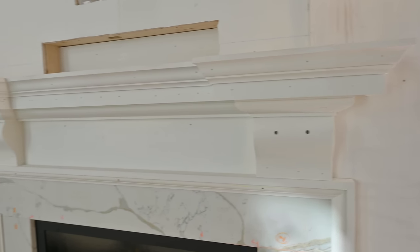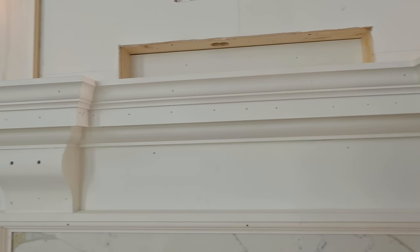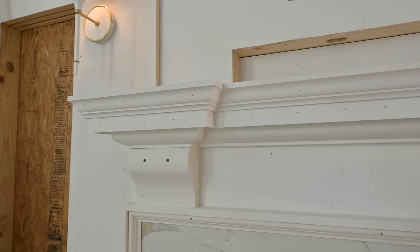We can now remove our temporary shelf top — this gives us visibility to our blocking locations and we drive a 15-gauge nail through our molding right into those blocking locations to really give this some strength. Just like that, we have ourselves a mantle shelf. We still need to do the top to complete the actual mantle, but that we'll get into in the next video. If you weren't doing an over-mantle, at this point you'd essentially be done. But we still have a pretty good long road ahead of us moving up the over-mantle.